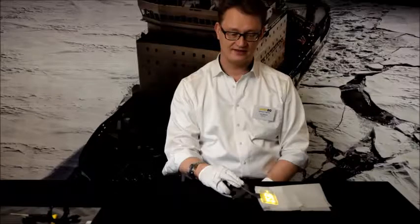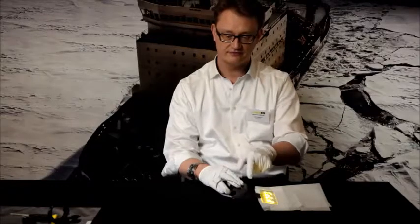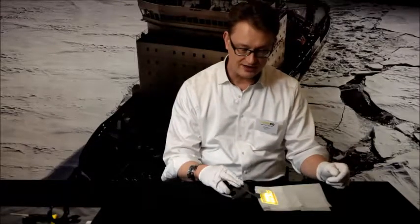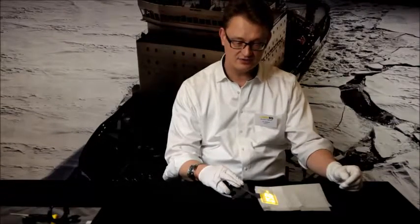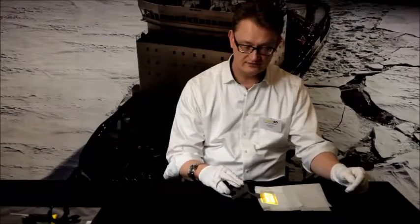So here we have the system up and running. We have the electrical box, the control box, connected with the flexible printed circuit board — the flex cable — to the display glass. And as you can see, it's running nicely. It usually makes this little high-pitched whining sound, but obviously when it's laminated to the glass, nobody can hear it. And of course, as it is non-encapsulated, it has absolutely no cover glass. It's very fragile, so pay attention when moving it and use some sort of a cushion underneath it when you do this test.